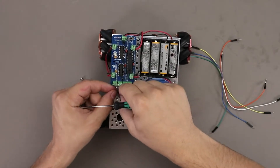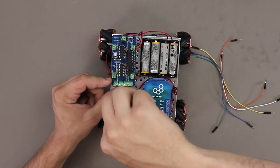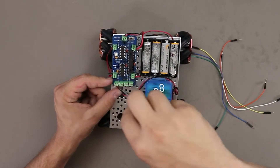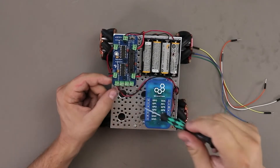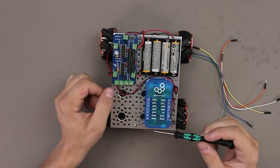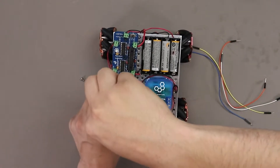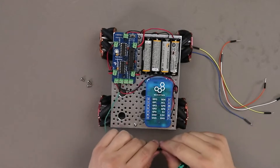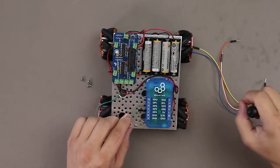The last connection type is connecting the TLC 5940's control pins to the Quantum BuilderBase and provides power to it. These pins can be found on the left side of the PCB. J6 terminal top gets connected to 5V on the BuilderBase. J6 terminal bottom gets connected to the ground on the BuilderBase.